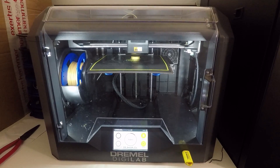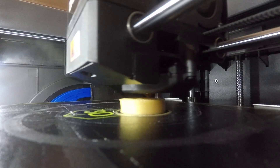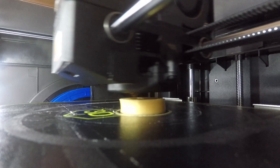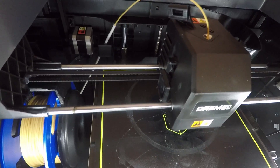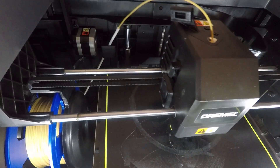Now on to our actual home machines. When people talk about 3D printing, they're usually referring to fused deposition modeling, or FDM machines. These are basically hot glue guns moving around on an XYZ axis with the precision of stepper motors. Imagine fishing line being heated around 200 degrees Celsius and then melting onto the previous layer.